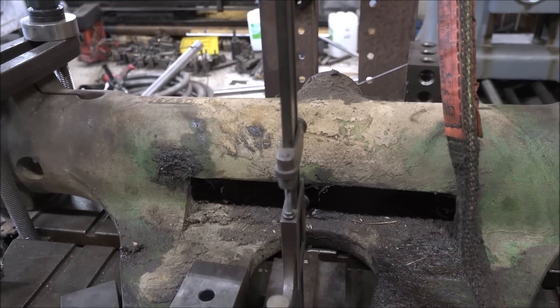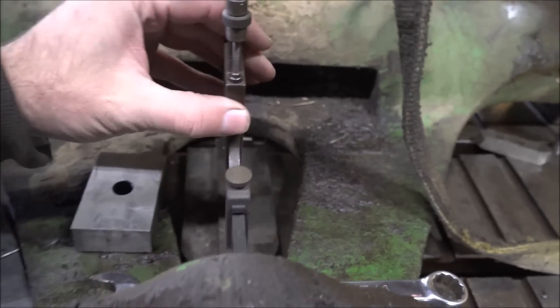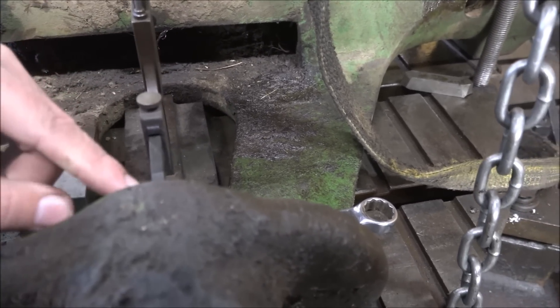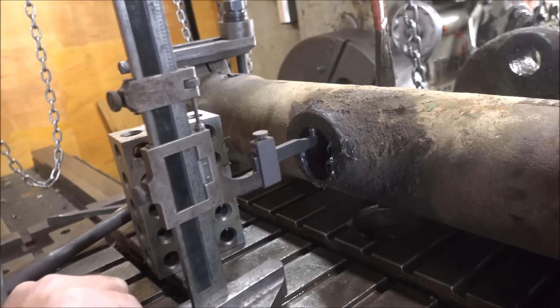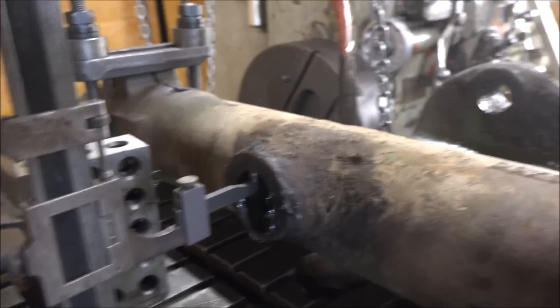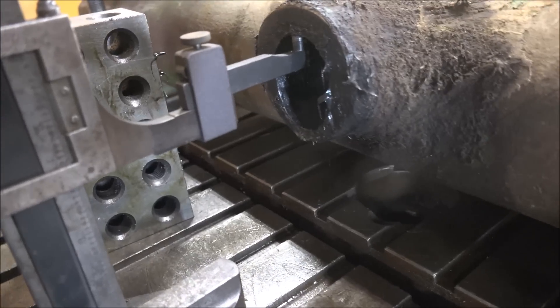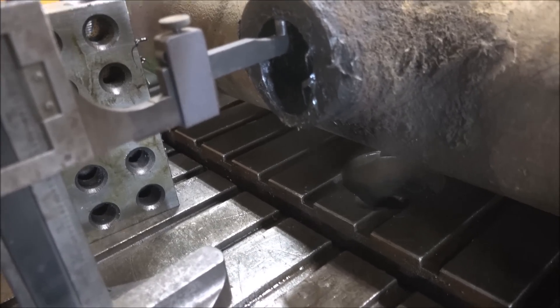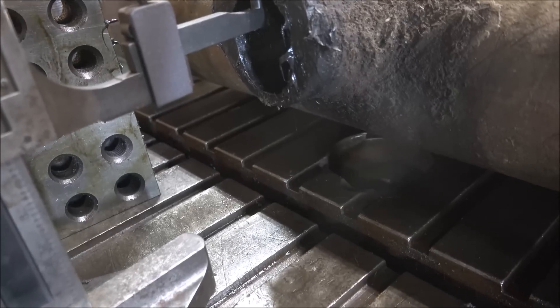Because same deal, it doesn't really matter how close it is. Most of your automobiles are not within that close of a tolerance on their alignment. Then I use a height gauge to set up so I've got it to where it's in the bore good. And then I can take it, translate it to the other side and do the same thing. Come over here and it's right there on the edge of the bore, so I know the tip this way is correct. That bore is not really something that you could sweep to determine its position.